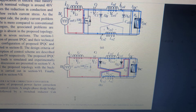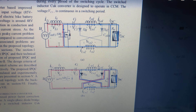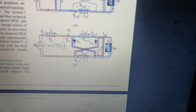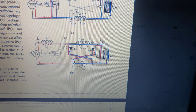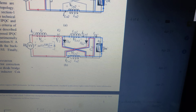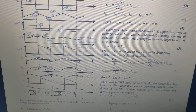There are two modes in our project. Mode 1: when the MOSFET is switching on, the inductor charges and discharges, and these two inductors deliver current to the battery directly. Mode 2: when the MOSFET is in the off condition, the inductor discharges through the diodes in a closed-loop path, and the inductor discharges to the battery output directly. These are the two modes, and these are the pulsating signals we provide to the MOSFET circuitry.